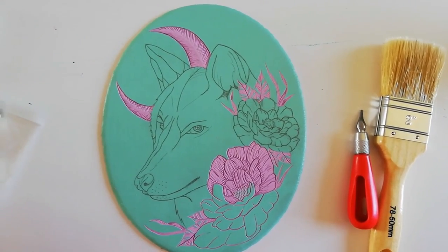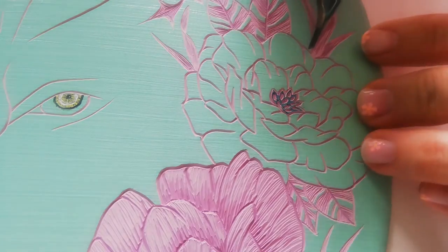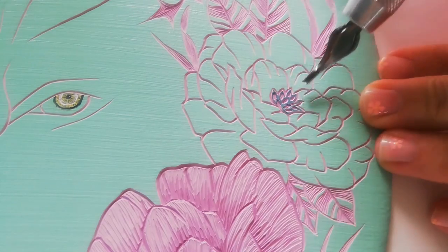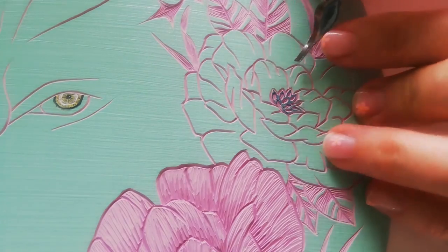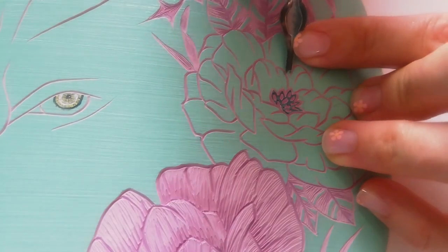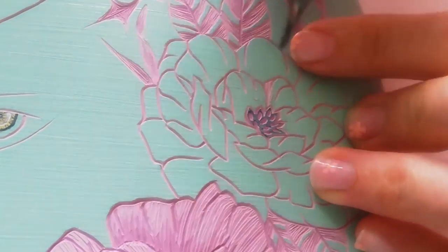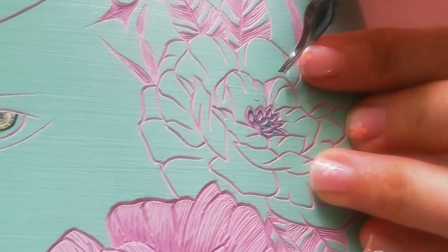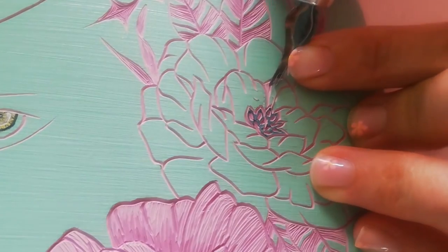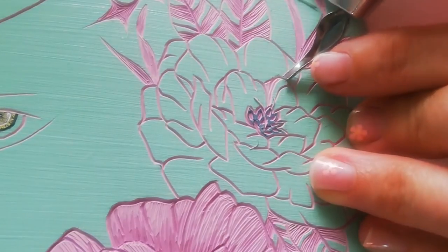This is what I got at day two of my carving. I'm going to start carving the last flower, and I just wanted to show you what I'm doing. I did the outlines and already did the center. I'm going to carve from the outside of the leaf inward, doing it lightly in the beginning and then going deeper at the end to get the color difference.